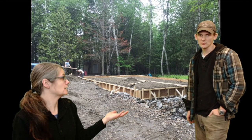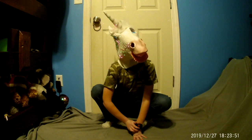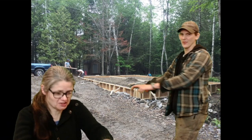The way we did it was taking a 2x4. It has to be level and it has to be below this level. We would take a laser level and hit a sight across from this side over to this side, and this bar in the middle was exactly in the middle. Then you take this screeding tool that we made and push it back and forth to make it flat, so that the distance between the top of the pad and the bottom of the pad was going to be the right distance.